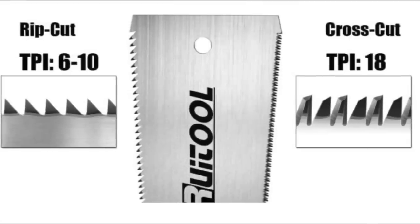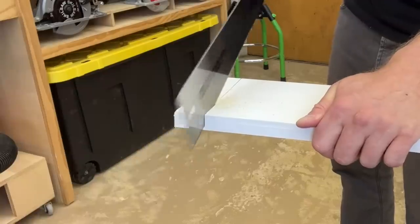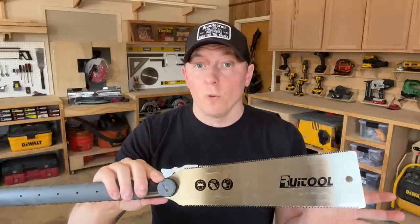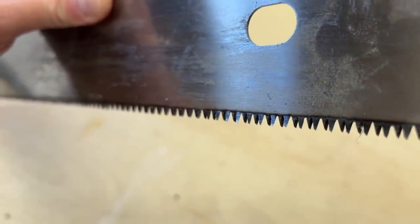Cross-cutting is more difficult, so you need sharper, less aggressive teeth to sever all the little connections of wood fiber cleanly. And there are more teeth on the cross-cutting side. Manufacturers gauge saws by how many teeth they have per inch — TPI — and cross-cutting saws will always have more teeth per inch because they have more work to do separating fibers. Japanese saws incorporate both of these tooth patterns simultaneously, giving them a real distinct advantage over western saws because you get dual purposes out of one tool. The compromise is that many western style saws have switched over to what they call tri-ground teeth, which are basically teeth that don't slant quite as hard and cut in both directions — it's meant to be multi-purpose, but the net effect is sometimes that you get a saw that isn't as great for ripping or as great for cross-cutting.